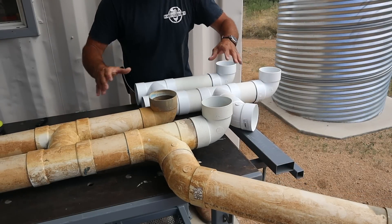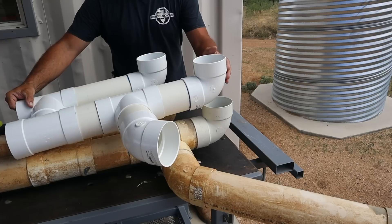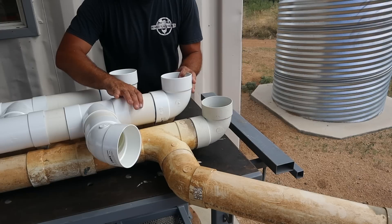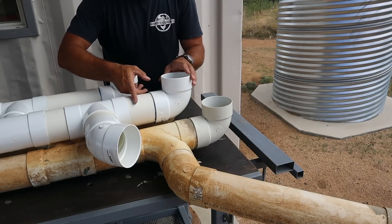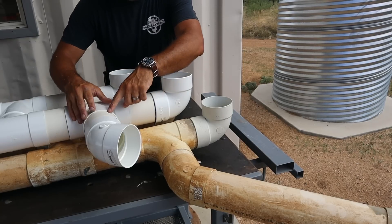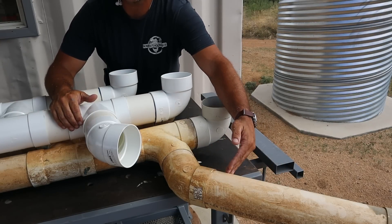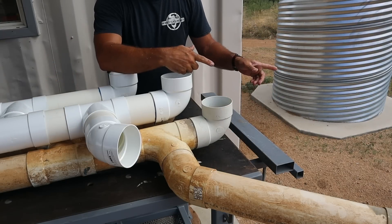You can see I have tried to match the spacing of these pipes with the old setup, but the only difference is that I left a little bit more space right here so that in case I ever need to do a future repair, that would save me all this trouble. I could simply cut here and just use a coupling to add a new piece on. I've also extended this out for the same reason so I can be able to repair it. Now I'm going to cut this long piece off and reuse all of this with the threaded end cap for draining, then install it on the pipes.